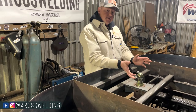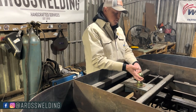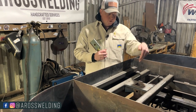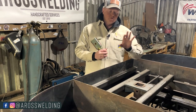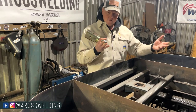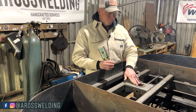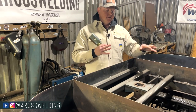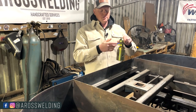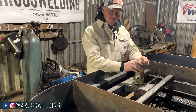Not only can you pull a regular gooseneck trailer like this, but you can also remove the ball itself and put your fifth wheel hitch in here if you want to pull your camper. The actual term is fifth wheel — with a kingpin situation, like a semi does. That's how I pulled my trailer the last couple of pipeline jobs I worked. I personally like pulling my camper with the kingpin versus the gooseneck, but I did pull our trailer with a gooseneck ball for several years.